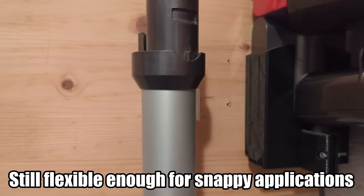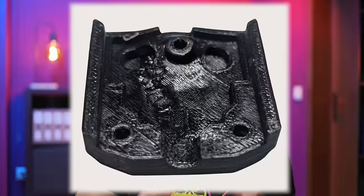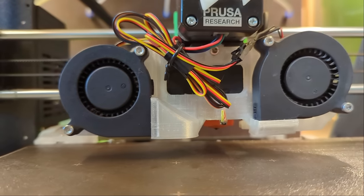That means it can take harder hits before it cracks and breaks. All these properties make them the ideal material for printed-part printers like the Voron or Prusa printers. The Voron Material Selection Guide specifically recommends ABS or ASA and nothing else, while Prusa prints most parts in PETG. Heat bed covers and part cooling fan shrouds need to take a lot of heat, so even Prusa prints them in ABS. In the case of my enclosed Prusa Mk3, even ABS wasn't enough, so I printed both from polycarbonate. Post-processing in the form of cutting works extremely well with ABS, and the higher melting point also makes drilling easier. Keep in mind it still gives off fumes if it gets too hot, especially when sanding — you should wear a respirator when sanding, and ideally use an attached dust collector. This applies not only for ABS but for any plastic and wood as well — any form of fine dust in your lungs poses a health risk.